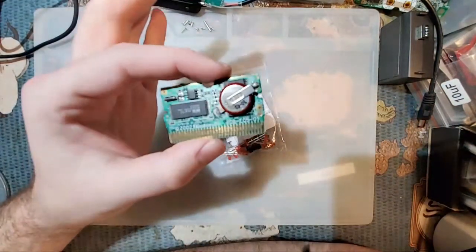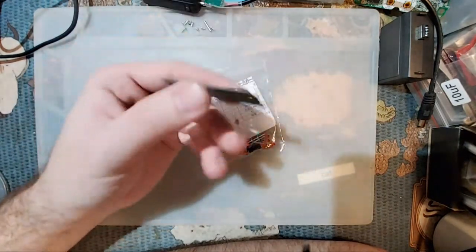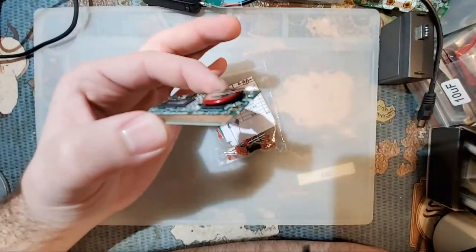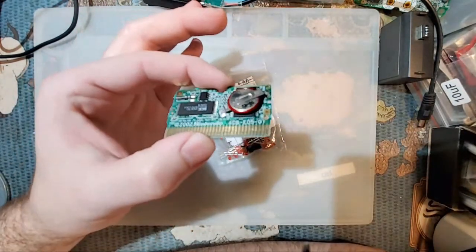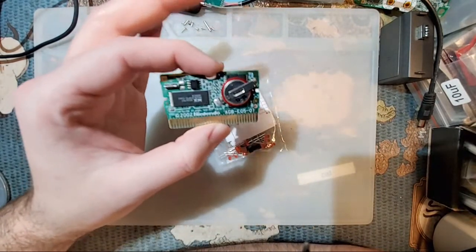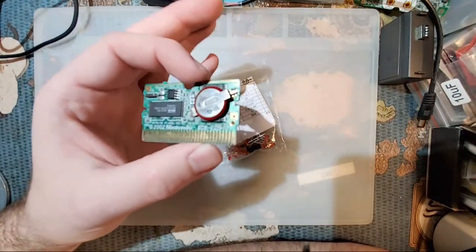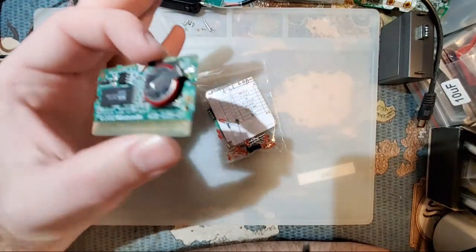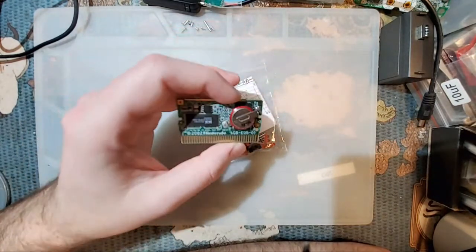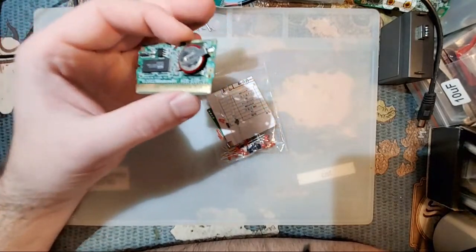A lot of games themselves have batteries. This one is Pokemon Ruby in particular. The battery, in this case, is only used for the real-time clock circuit, and it is literally irrelevant to the rest of the function of the game. So if this battery dies, all you lose is your clock and any events that are based on the clock. So for the example of Pokemon Ruby, that means you can't grow berries anymore. I mean, some people that's important. To most people, that's not at all important.